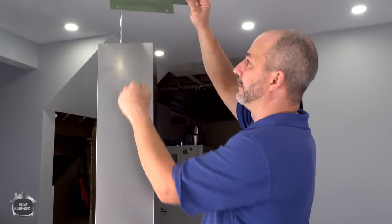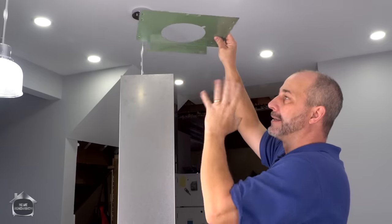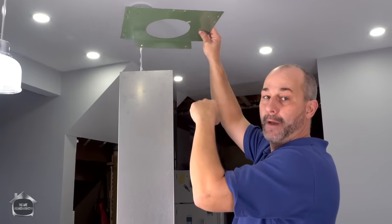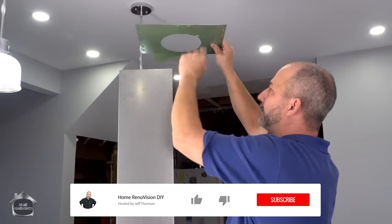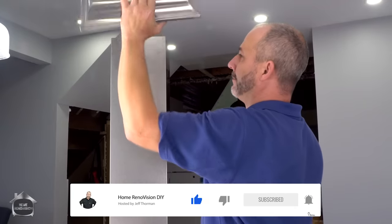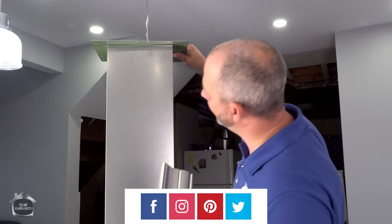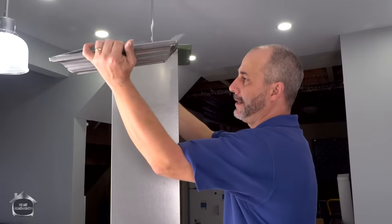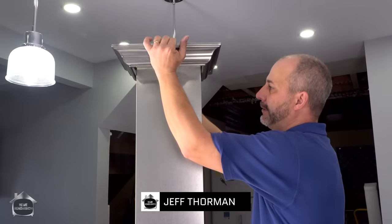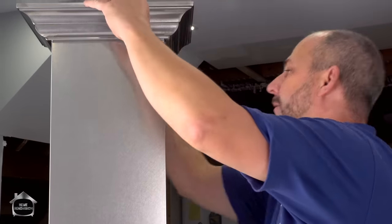And then there's this. This wall plate actually installs against the wall at the ceiling height, okay? And it's cut out like this in case you have an exhaust that goes up through the roof and out through the roof. Since ours goes out the side, we don't have to worry about the hole, but we do have a decorative trim for the crown molding. So, you mount that on the wall, you leave just a little bit of room from the ceiling, and then you can slide this crown molding to get that finish. That's the designer finish. It's sleek, there's no joints, right? You can wipe it down and clean without slicing your hand open on that exposed edge, and it looks pretty good. So this is what we're gonna do.